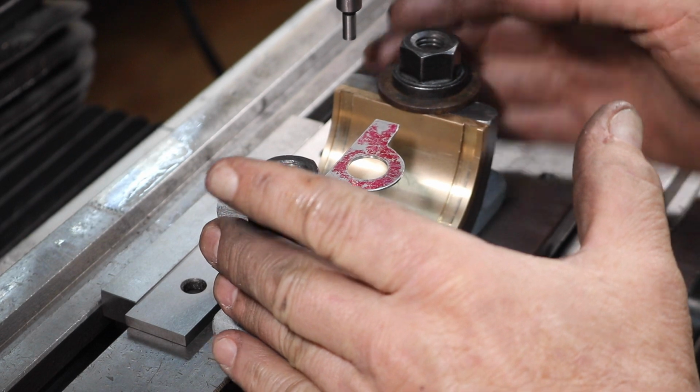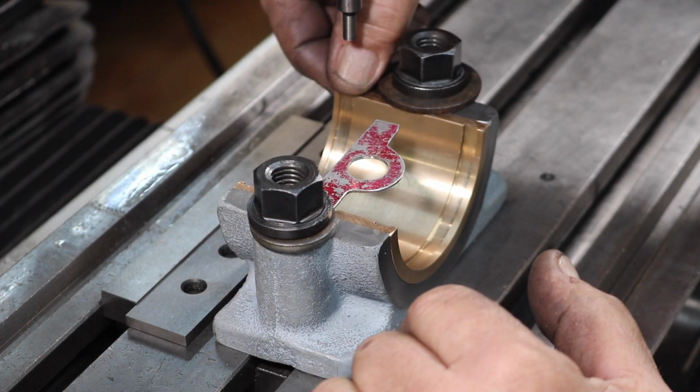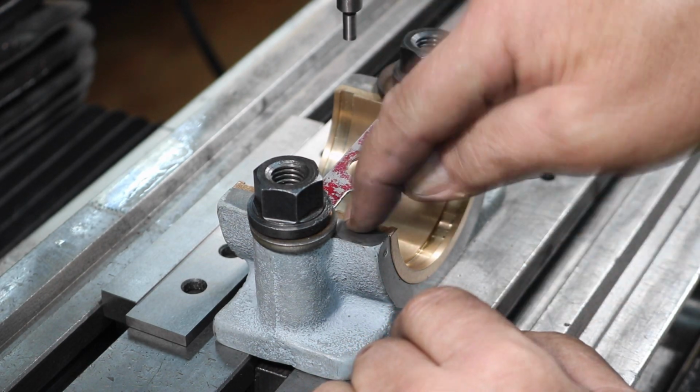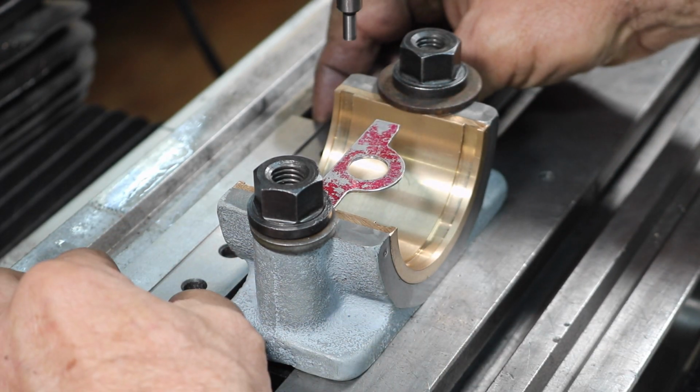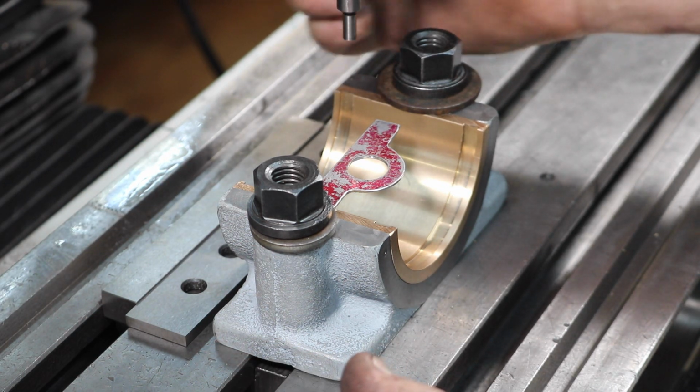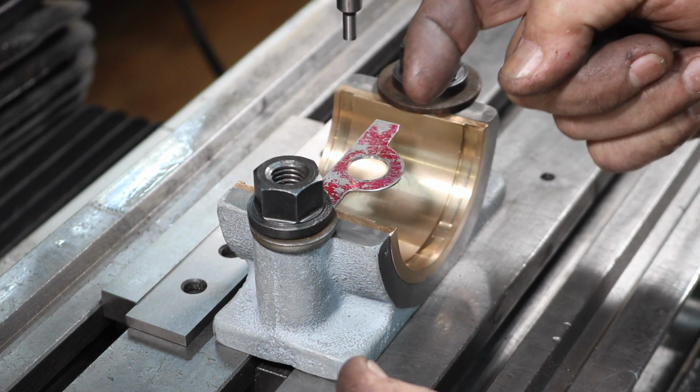All right, we're bolted down. I just put a washer on this side, that way it's pushed up flush there, and just a few thousandths down here with a shim pushing on it. And we're tight with our parallel and our fence. Edge find the block and then come in.